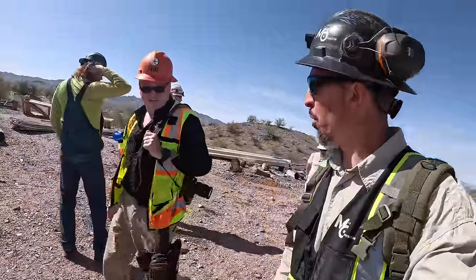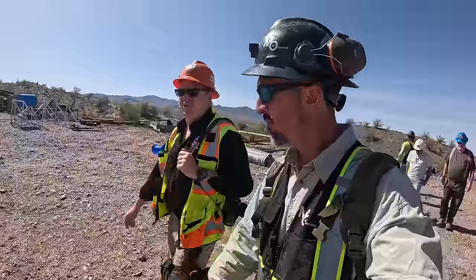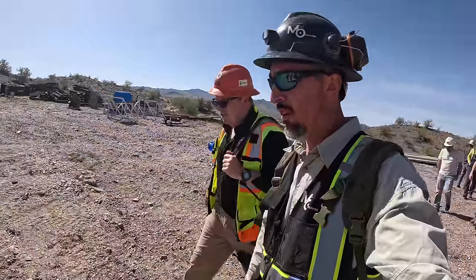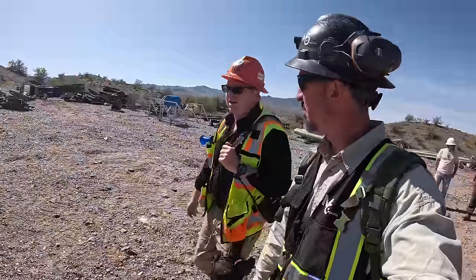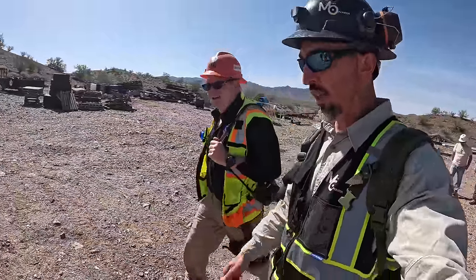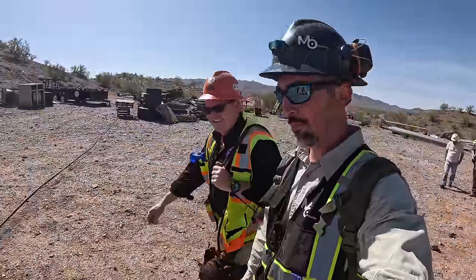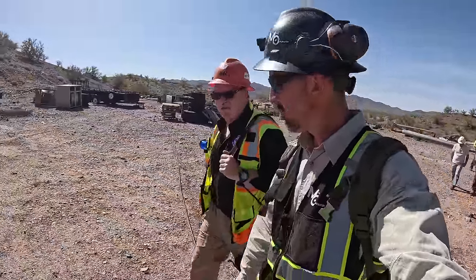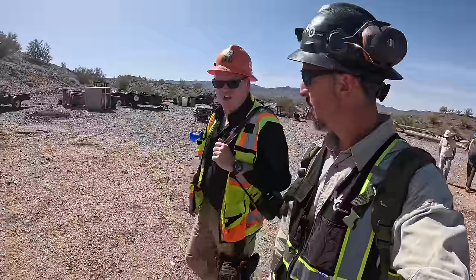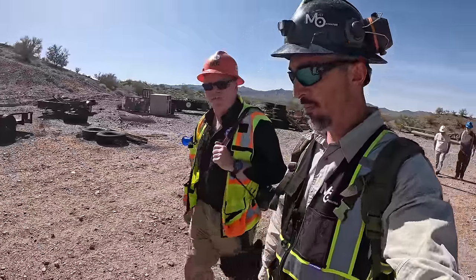So Jack, this is a boulder buster, right? It's a rock crusher. A rock crusher. Yep, by a company called Austin Powder. All right. So it's a 1 pound charge of a material called RDX. And that saves from having to even drill a hole. That's the idea, because drilling's hard work. So this way you can just set one or two or three or four of these charges on very large rocks, and the energy goes into those rocks and breaks them up nicely.